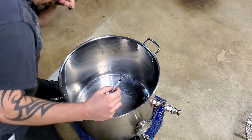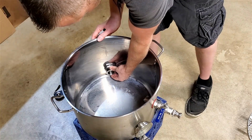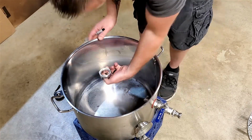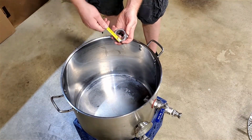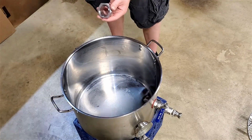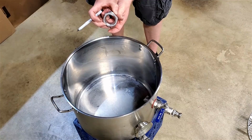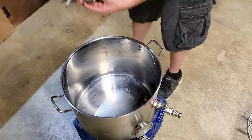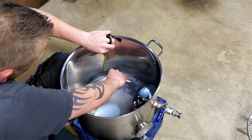Wherever I mount this, I know that that nut can't go past. Bottom of that nut can't go past that. Because obviously too, this is 2 inches, but if you measure on the hex, that's 2 1/4. Now granted, I should be able to turn this potentially, but if I end up like this, I don't want to be on that ridge either, because the last thing I want this to do is leak. So what I'm going to do is come up 2 1/4 from this now, which is the furthest point of this thing. Where's that going to put me?